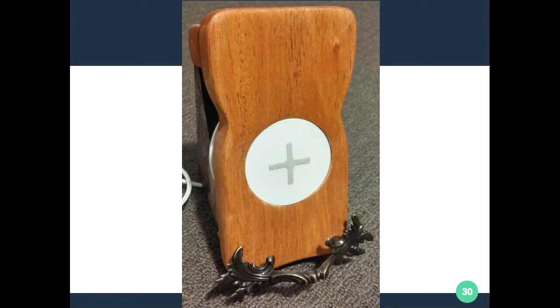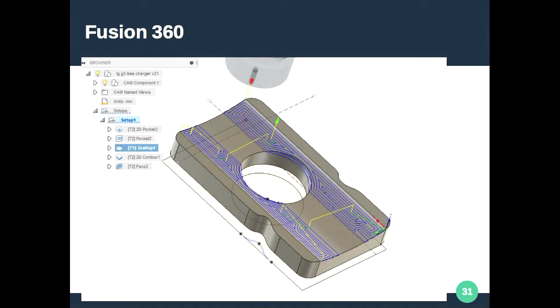The bottom part of this piece is actually bought rather than milled — to make something like that I'd need a proper five-axis setup and I'm not there yet. Another useful CAD-CAM tool is Fusion 360, which you can download and use free if you're making less than $100,000 a year on it. It's closed source, but depending on which battles you want to pick — if you want to stick fully with GPL software that's viable, but Fusion is available at no cost. The previous piece I made in Fusion while playing around with ball-end toolpaths.